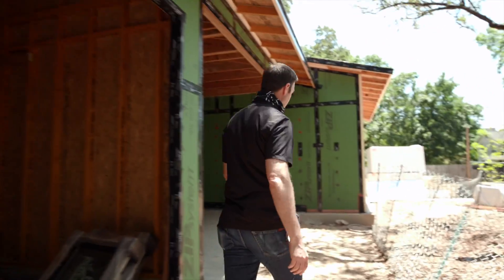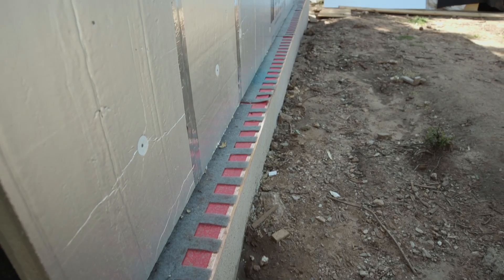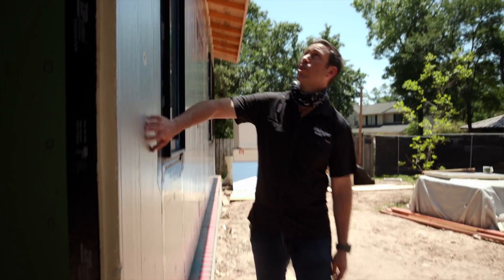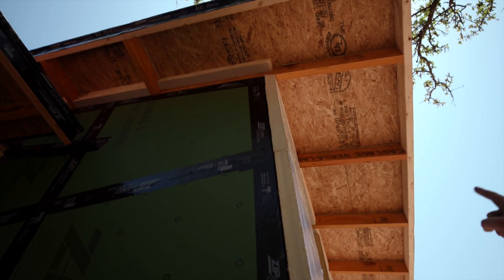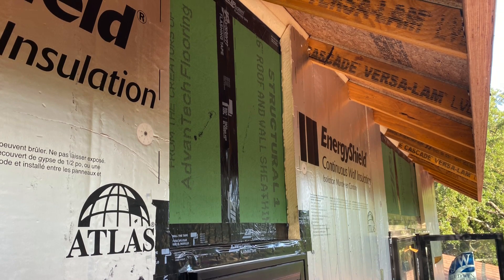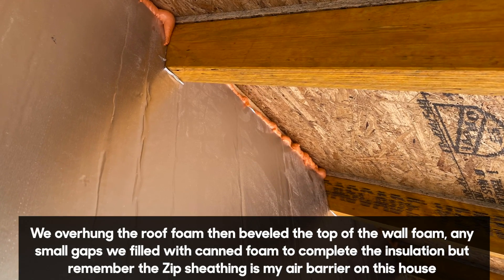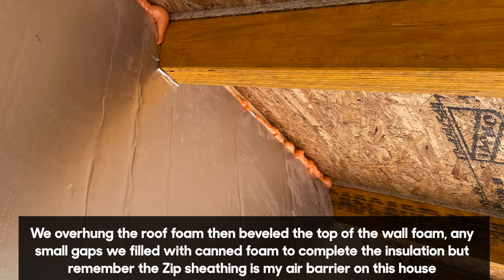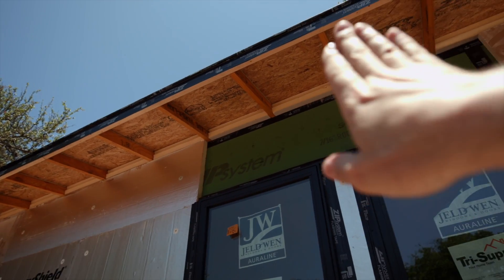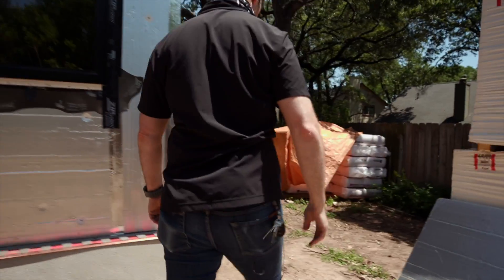Walking around to the front of the house — this is my three-wall flashing at the brick area — you can see this foam coming up the wall. There are my two layers of two-inch foam on my roof deck, and my wall is going continuous all the way up to my roof. So my wall insulation, when it meets the roof, dies right into my roof insulation. The guys cut the wall insulation at an angle where it hits the roof and got it nice and tight up there — they did a great job.